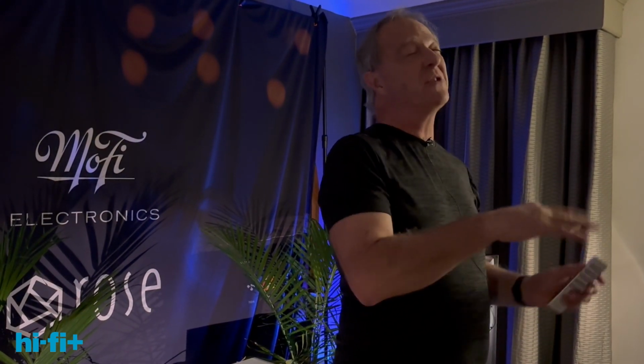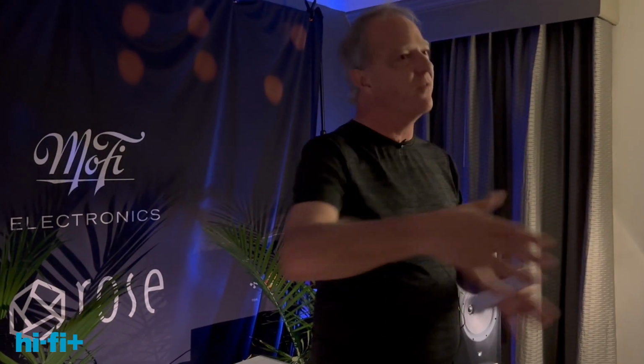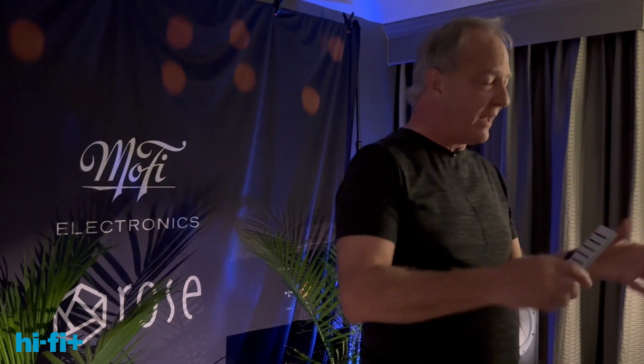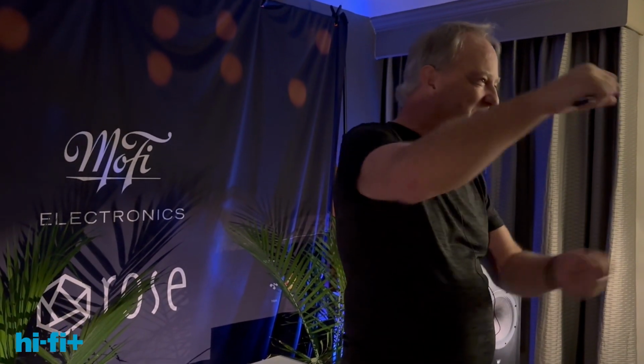The other way to do it is, let's say, a piecewise approximation to a constant curve. You cut facets. So all different distances all around the driver and different angles of facets moving backwards. And so that helps disrupt that diffraction. So that worked quite well. I got foam core board and kind of cut it up into that shape to test the idea.